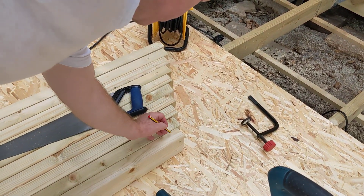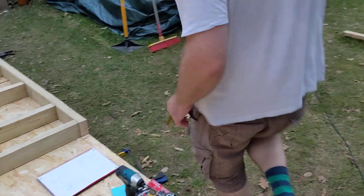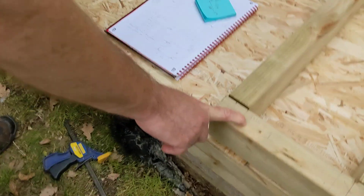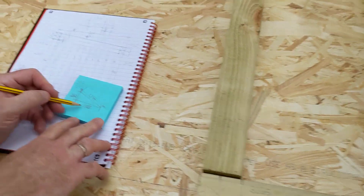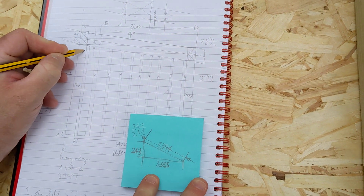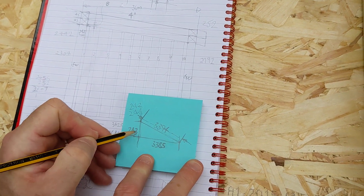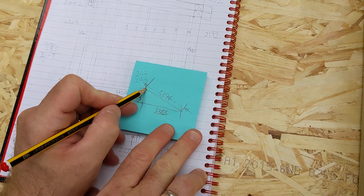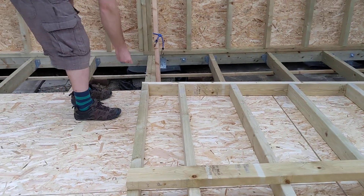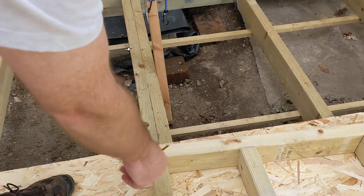So I've got ten studs here for this wall. Then, the last step to get the top plate was: I know that my bottom base plate here was 3385mm, and the difference between this line and here was 242mm. I put that into a rise and fall calculator — a pitch calculator. So I've got 243 up, 3385 across, which means this piece has to be 3394. So I cut the top plate at 3394 with a 4-degree edge. That's 4 degrees, and that's 3394.